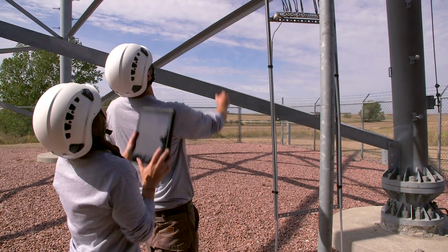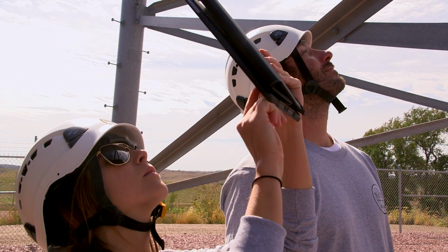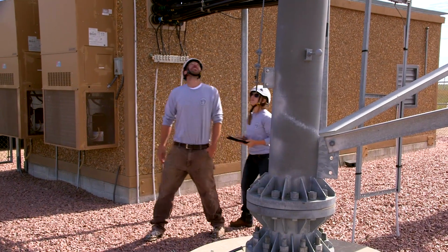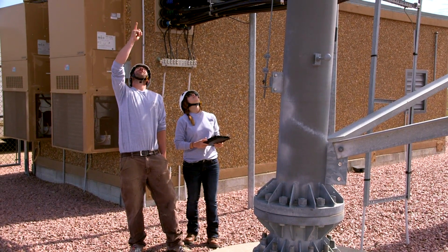Also perform that same visual inspection on any feed lines or SO cords to ensure that they're properly secured to the tower. Sometimes it's easier to spot any defect in vertical runs by looking up from the base of the structure at a different angle than when you're climbing.